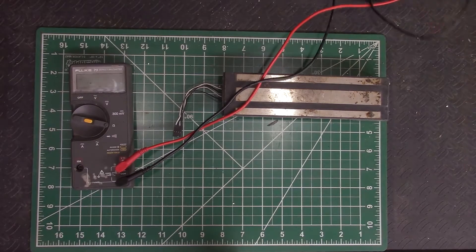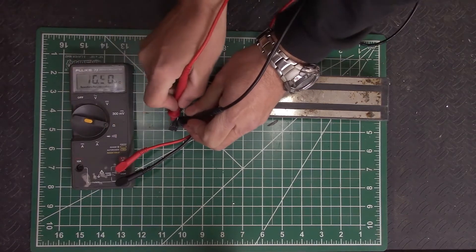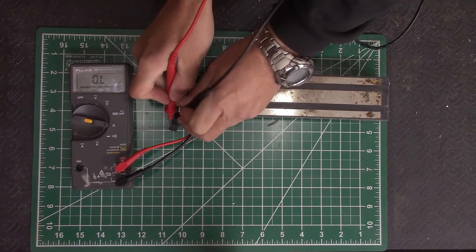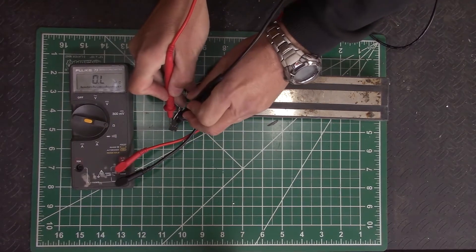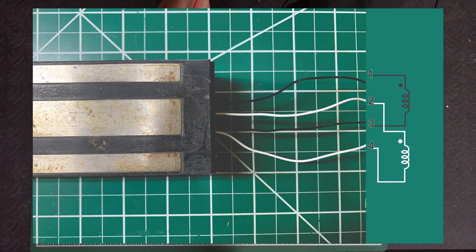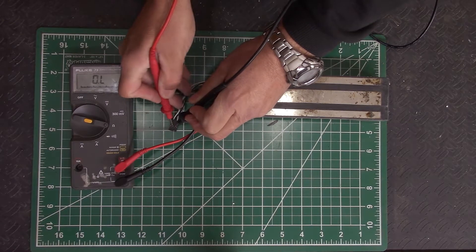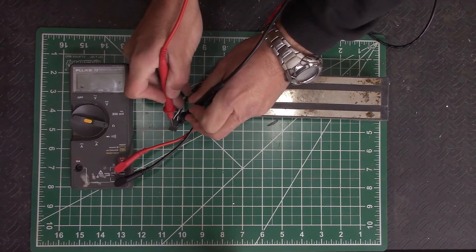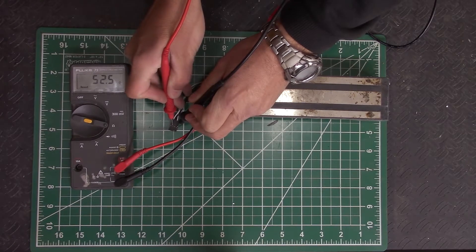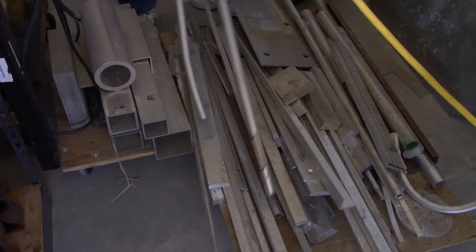I see four wires coming out and I'm wondering why four wires and not two. What I learned by using the ohmmeter to measure the resistance between the four wires was that there are two windings. They run from black to black and from white to white, measuring around 50 ohms each. Internally they were wired in series through a very simple circuit — basically a FET and a diode. I'm actually going to wire them in parallel to enhance the power.